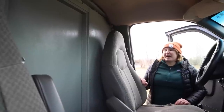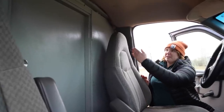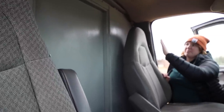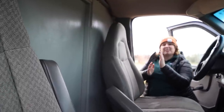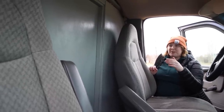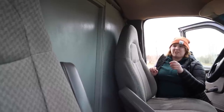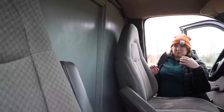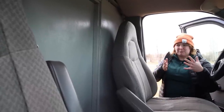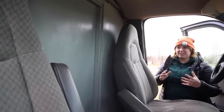How I built this wall was I took two-by-fours and made a frame for the door. I put king studs, put all of the studs in first, and then I put the quarter-inch birch plywood on top of it. On the other side I put in my poly-iso insulation — two inches — because with all the windows in here that's where a lot of temperature fluctuation would come from. I used a regular doorknob with a lock on the inside, so if somebody tried to break in there'd be multiple barriers.